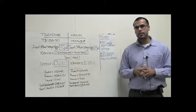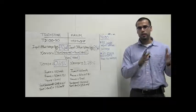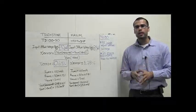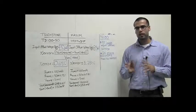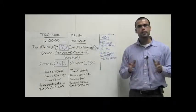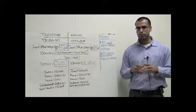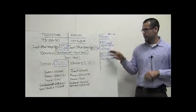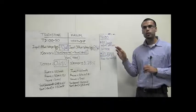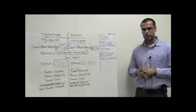In addition, the TS-1100 consumes less than one microamp of supply current, can be used in applications operating from 2 volts to 25 volts, and is available in four gain options of 25, 50, 100, and 200. This makes the TS-1100 an ideal solution for load current measurement and power-conscious applications. In summary, the TS-1100 exhibits three times lower input offset voltage and is two times more accurate than the MAX-9634.